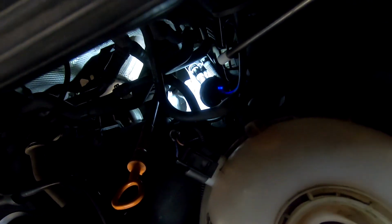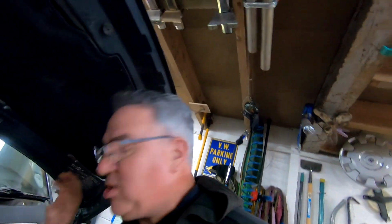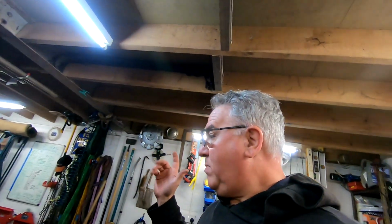Anyway, the pump is obviously in the engine bay, which is very dark. Let's find my torch. I put it down there strategically. There we go. So the water pump is down in the belly. Hang on, I've got a pointer. Look, I'm all organized. There it is. It's behind that cover there, so we've got a few bolts to take out. And we've got a few things to remove to make access easier, like the water bottle. I don't know, we might be able to get away without removing the gear linkage. We might have to just take some bits off as and when. Anyway, blimey, 5 minutes and I haven't even started anything. So the first thing we've got to do is drain the coolant out.